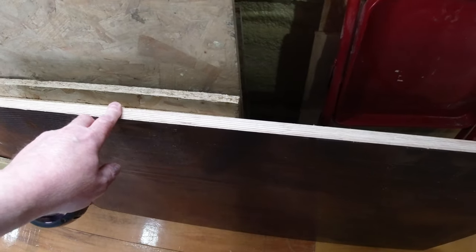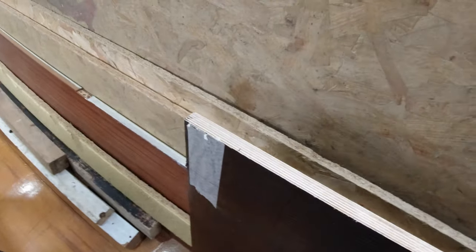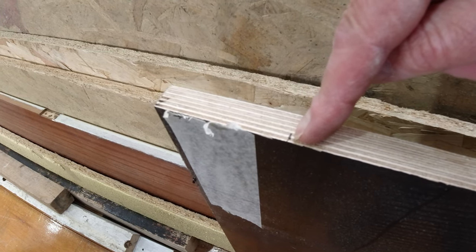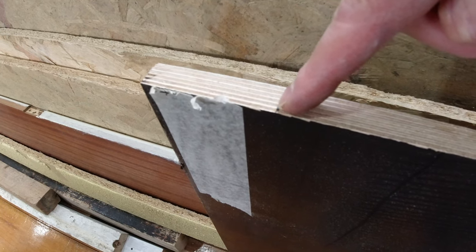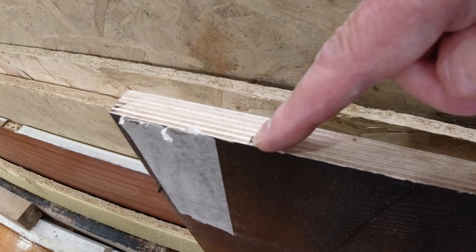This is still four feet - I did get hold of these in three by four foot sheets, so it's a quarter of an inch over four foot actually. But I need to make sure that it's 46 and a quarter. So if I measure 46 and a quarter from here to here, which I've done, put a mark on there. Then set the rip guide on the saw so that my blade is just to the left of that mark, because I've got to take into account the width of the saw blade. Then it should take off the exact amount that I want to remove.